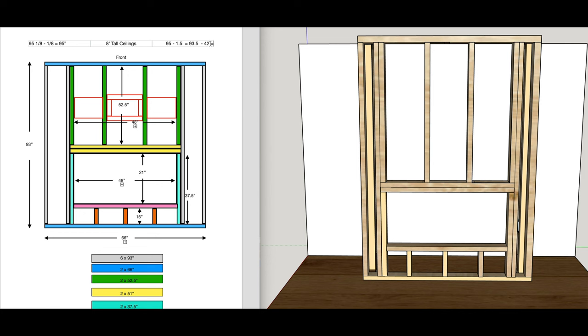For the two side walls, the main thing to calculate is the length of your top and bottom plate. I decided I wanted my fireplace to stick out 20 inches from the wall — far enough to allow cabinets beside it if wanted, without taking up too much room. The bottom plate is 3.5 inches wide, so 20 minus 3.5 equals 16.5 inches. You'll need four plates at 16.5 inches — two top and two bottom. The vertical gray studs on the side walls will most likely be the same length as the gray studs on the front wall unless your ceiling is wildly out of level.